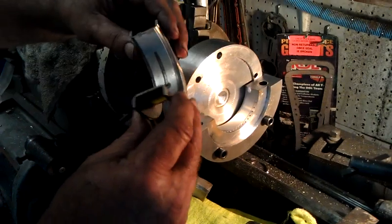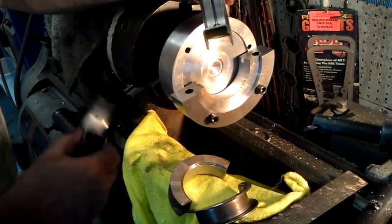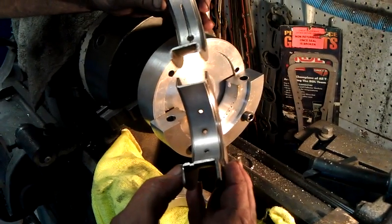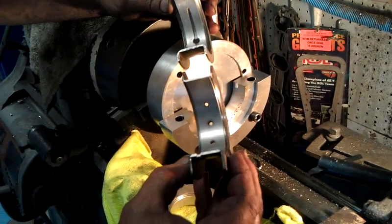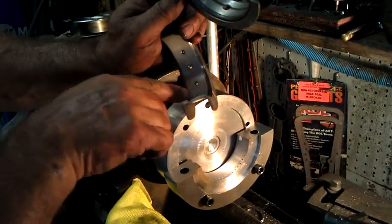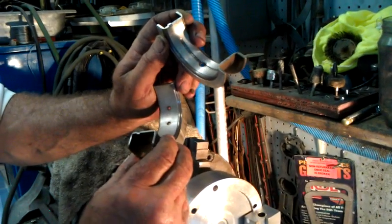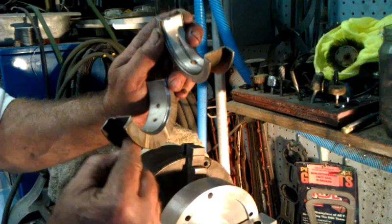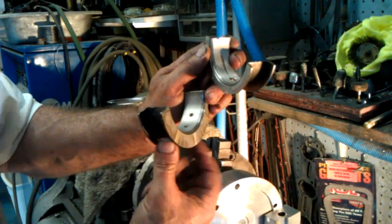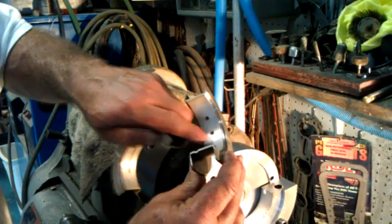We've also looked into a different style bearing that comes in on a truck. The truck bearing has a much, much bigger thrust surface on it, which will fit in the Dodge Viper block, but you have to redo your indexing tangs and cut a groove in the upper half of the block to accommodate four different oiling holes — or five with some brands of bearings. You take a die grinder or a small cutting tool and cut a big groove in the block, and the oil from the single line in the Dodge Viper block gets dispersed, feeding this bearing in either four or five different areas, or you can simply drill a hole straight in the center.